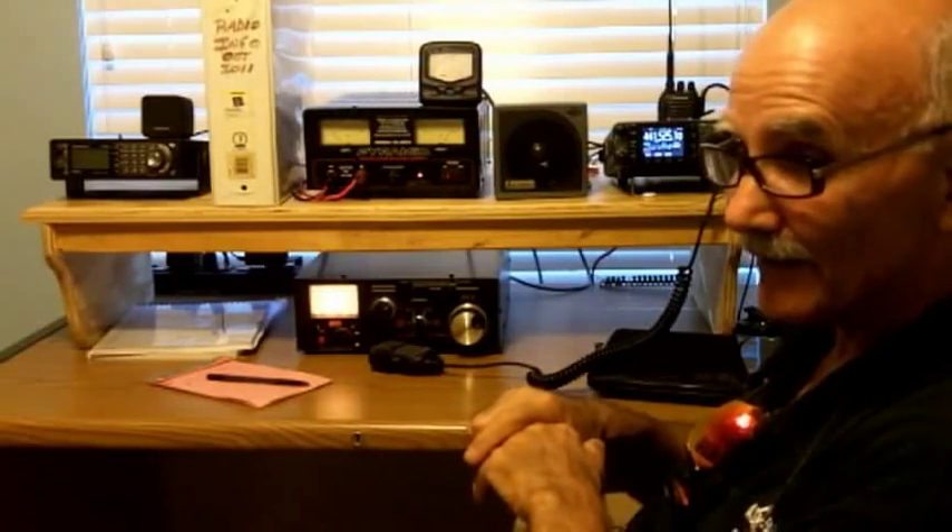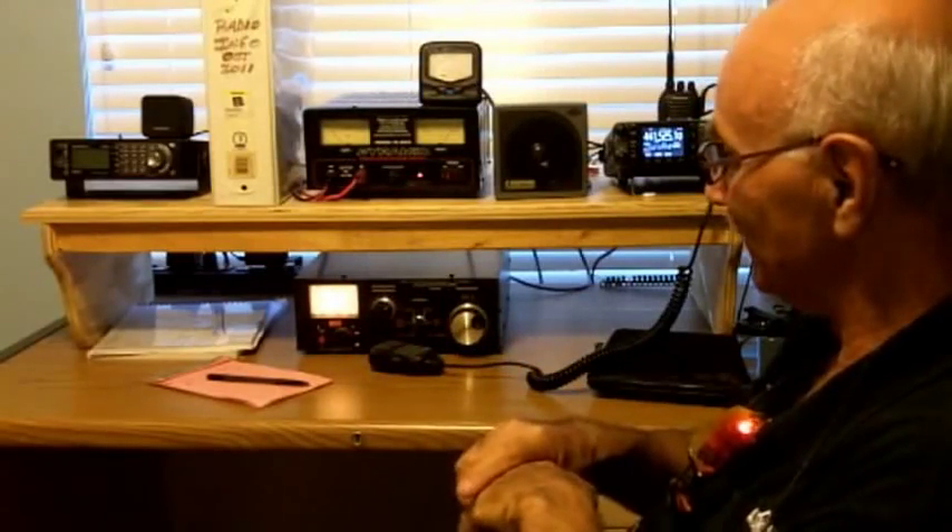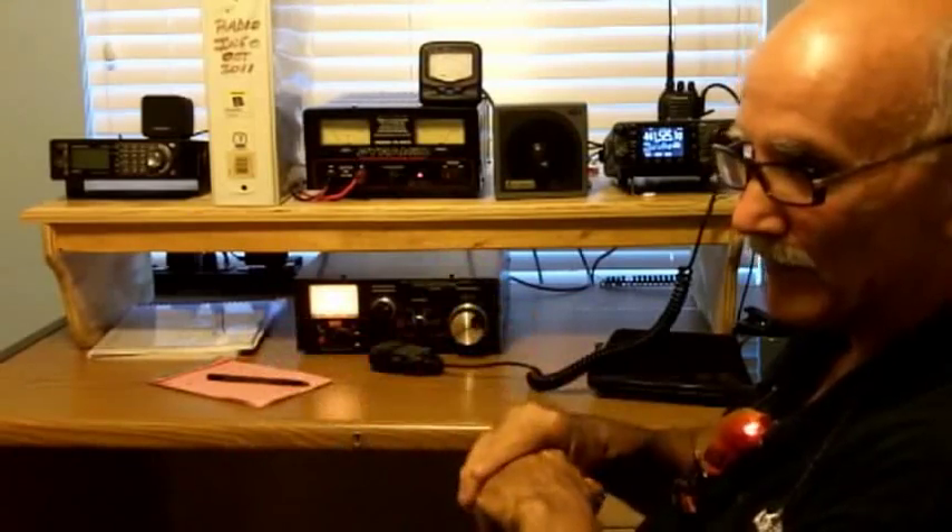So with that I'm going to break the video and get a close-up of this antenna tuner, and tune up on 10 meters. I've got you zoomed in on the antenna tuner. We're going to switch over to the 10-meter band and check the antenna to see if it's resonant. I'm sitting at 28.394 MHz right now. The first thing you want to do is turn down the power on your radio — I've got it down to about 17% of full power, around 20% or less — to play safe in case you have a bad mismatch so you won't do any harm.